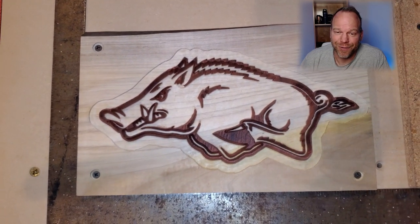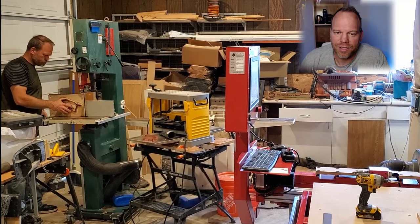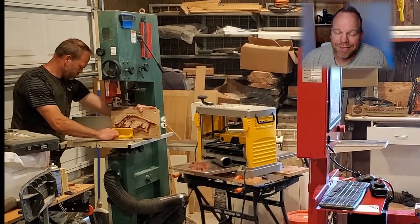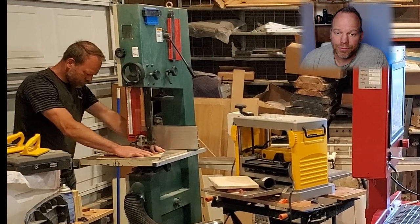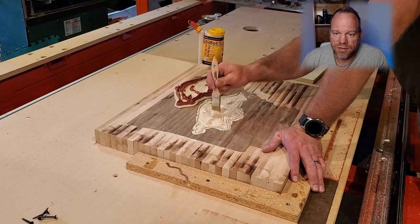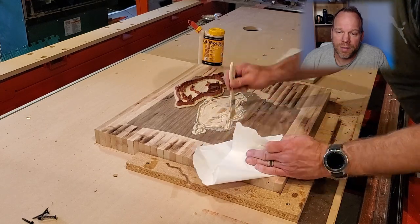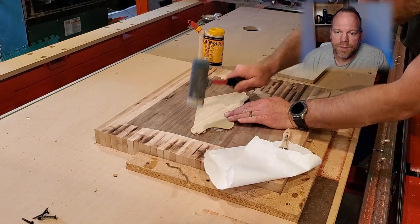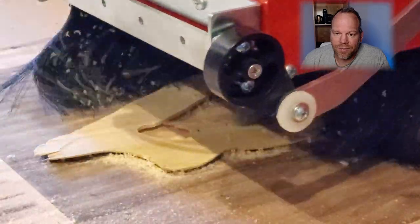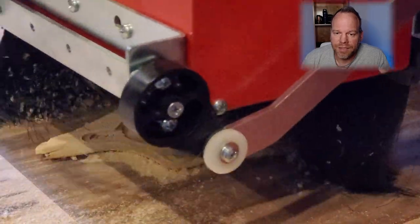That's looking real good so far. Hey, if you're enjoying this hit the like button — just show me that you like the content and you want me to keep going. Here we're going to take the Grizzly — that 17-inch bandsaw with the 10 or 12-inch resaw capability — that is just so nice for working on bigger projects like this. We've got that trimmed up. Again copious amounts of glue — actually that looks like too much glue, so I'll take some back, but I wanted to make sure I had glue everywhere. Get it set in there, hit it with a hammer, put some weight on it, let it dry overnight, then take that inch-and-a-quarter bit and hog away the material on top.